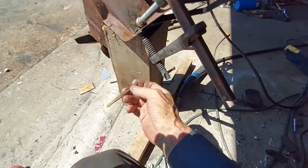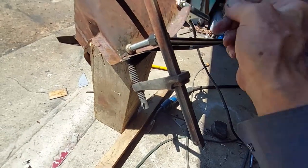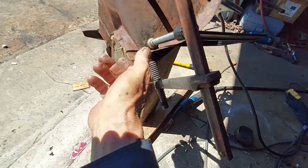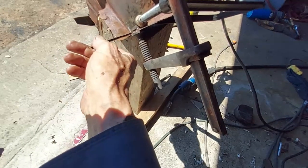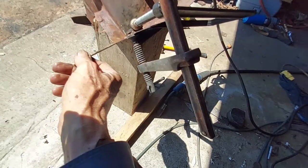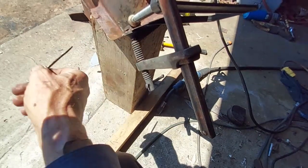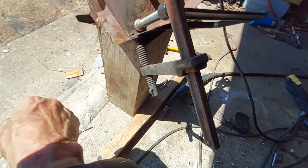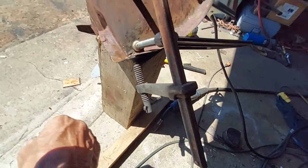This one I'm going to use a different technique. The crack goes all the way back to here. Normally I would start at the back of the crack and come forward, but I've got a missing piece right here. This needs to move over. I can't really hammer or pound it much more than this — I've used two big clamps to kind of get it where it's supposed to go. So I'm going to use the same spot welding technique, but I'm going to use a piece of filler rod and just fill that hole up. I'll take my clamp off because I don't want to weld my clamp to the metal, and then I'll fill this corner crack.